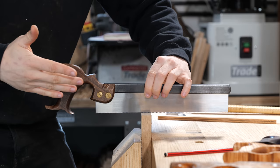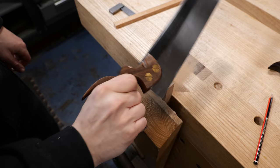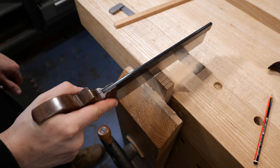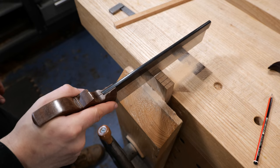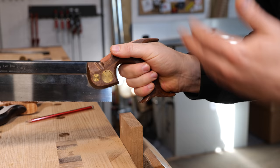Next, we're going to focus on grip, comprising both gripping the saw and what to do with your other hand. These saws are designed to be gripped with three fingers — your pinky, ring finger, and middle finger — around the handle, whereas your index finger points down the blade. This is way more comfortable than a full fist grip, and you'll find it stabilizes the saw a lot more and keeps it tracking straight. With a full fist grip, simply varying the grip strength causes the whole thing to wobble; pointing the index finger down prevents that.